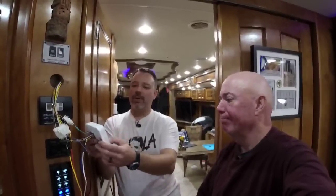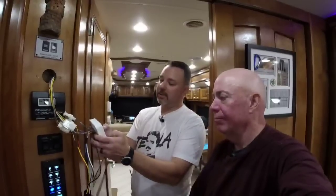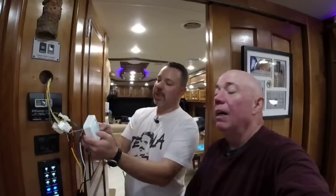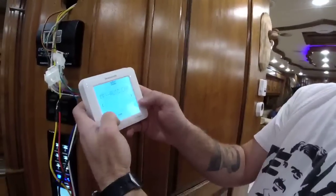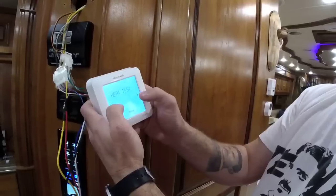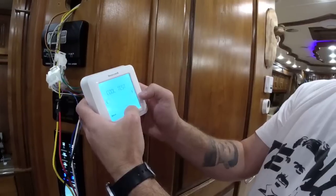Yep. So what I'm going to do is back out of this and go change that setting real quick, just because I can. Heat pump, air to air, OB heat, compressor, good. Edit. So we're changing aux/E stages to zero and hit done. Emergency stages. Yep. And then we're going to go back to our system test. And now we do not have an emergency heat test. Yay. And we're going to do the cool test.